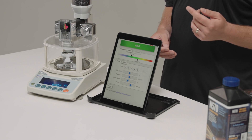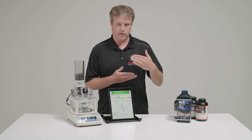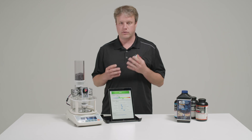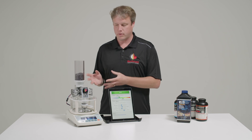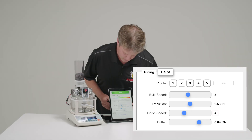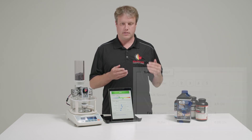The initial part was good and the transition was okay. But once the small tube started, there was a lot of powder at once and we could hear the motor go right down to a slow speed. The kernels are so heavy that it only takes one kernel to jump you from just below your threshold to over your threshold. So you have to expand your tolerance to be plus or minus one kernel. Let's try to reduce that by lowering finish speed by one notch to 4, and I'm going to increase buffer to 0.08, just so it runs slower at the very end, to avoid the chance of two kernels falling at once.